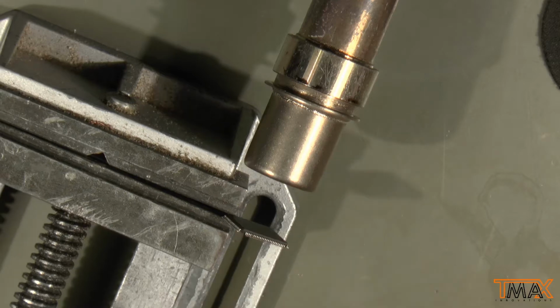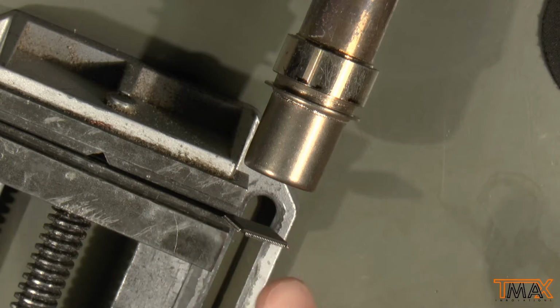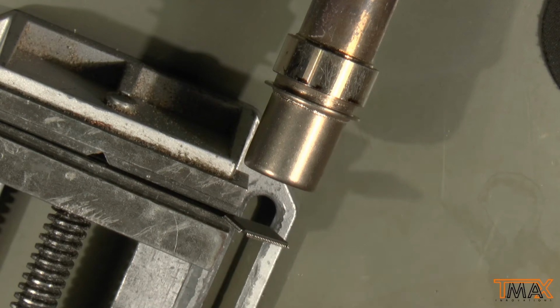Now, I've seen quite a few videos online that tell you that you can decap chips without acid and without anything nasty, by heating them up and then trying to carefully crack off the epoxy. And I think I might just give that a try, because it is dead, but it's not entirely dead. It pulls like 2 amps, or even more. I think I limited it to 2 amps and it got to like 4 volts or whatever.